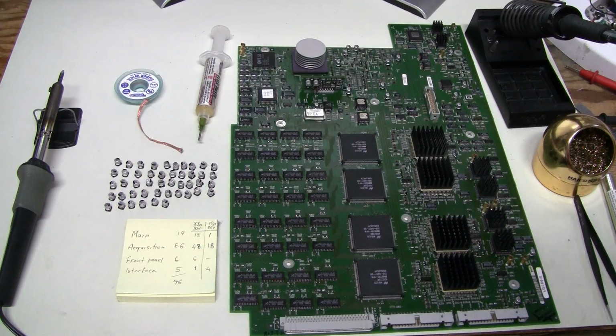Perhaps I need to desolder this little board first, which is really easy to do. I have a desoldering station with vacuum for desoldering through hole components. I don't remember how I did this with my 540A scope, which I repaired several years ago. And I do remember about the 620A scope, and I still have a photo of the acquisition board. The acquisition board there is completely different, and there is no such board on it at all.